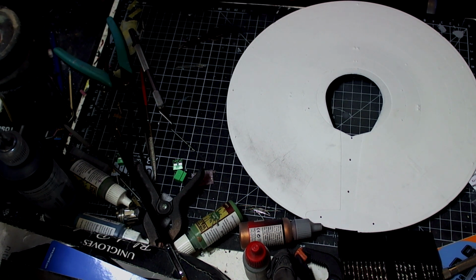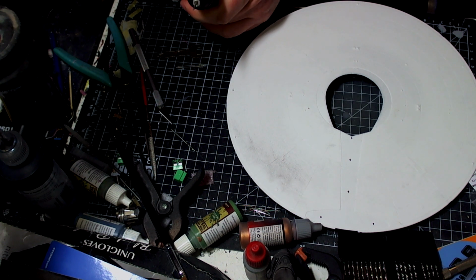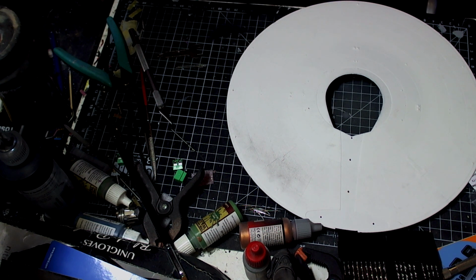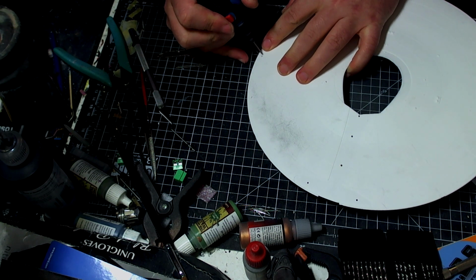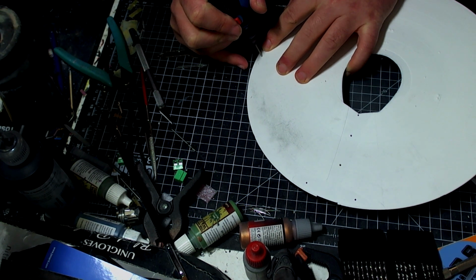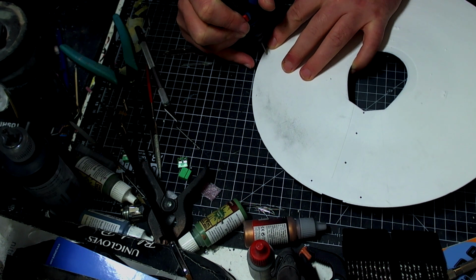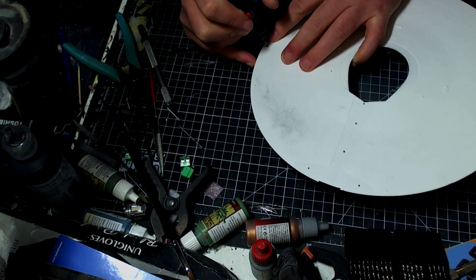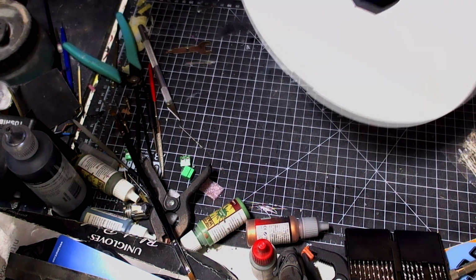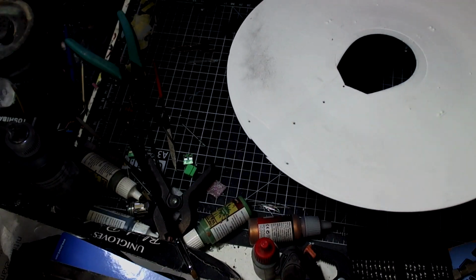There we go. Whoa, too fast, too fast. Bring it way down to about 1. Okay. And now, hopefully, because I've got that little thing there, I can then drill out a 2mm hole. Let's close that off. Just need to do a little bit of clean up here.